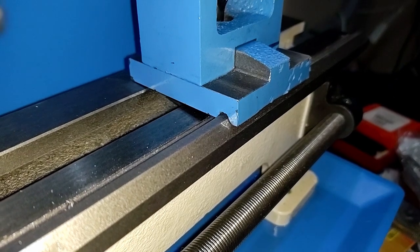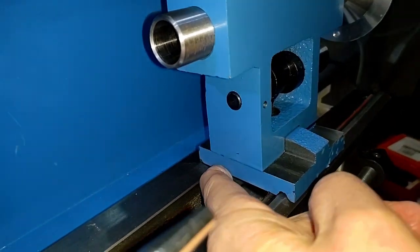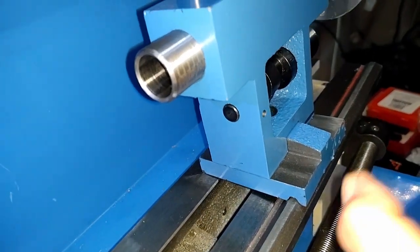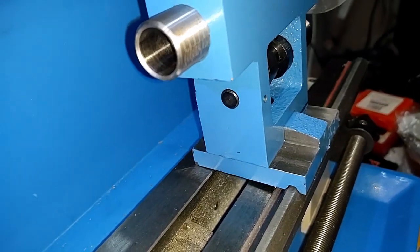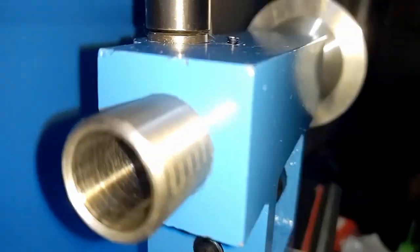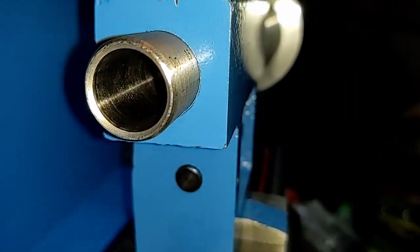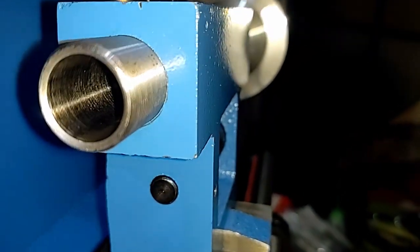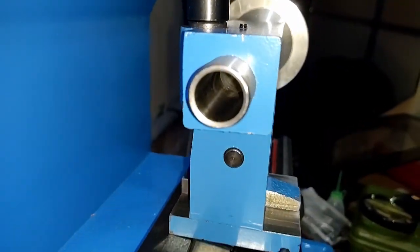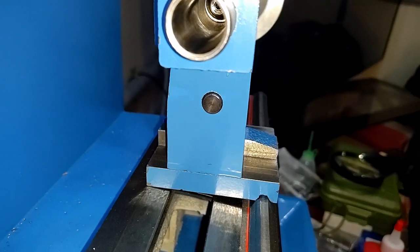This also makes it very, very hard to adjust. There's an issue in adjusting that. The screw on this one to adjust for windage is located up under here. It's recessed in, which there's no reason for it to be recessed in whatsoever. The recess is on a slot, and that gets cut so you end up with the position it wants to go in, even though you don't want it in that position. So that makes it also difficult to adjust. And the net result is, because it's difficult to adjust left to right, as it moves left to right it also moves up and down because it's on a bit of an angle. It makes it very, very hard to properly align the center of that tailstock to the center of the spindle. That's my problem. Let's see what we can get done about it.